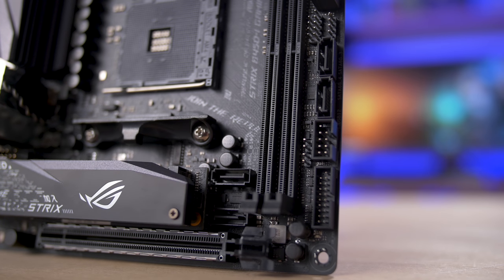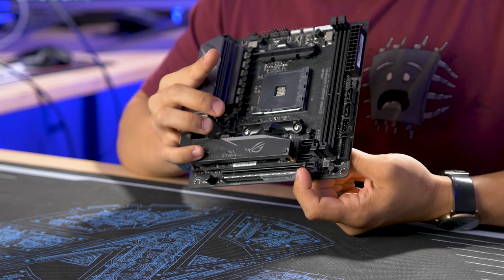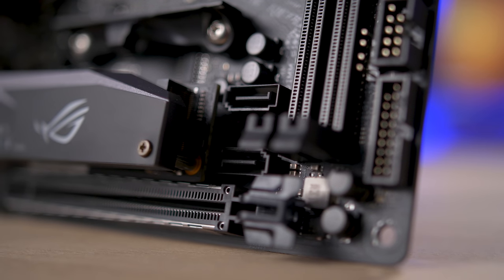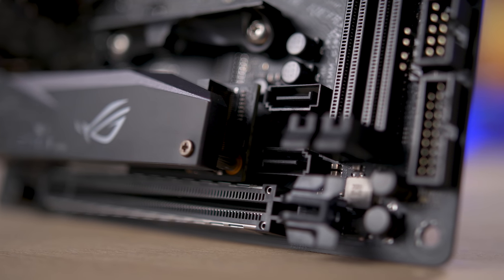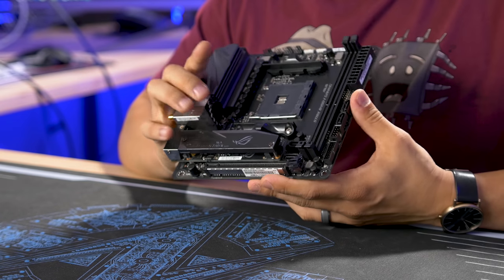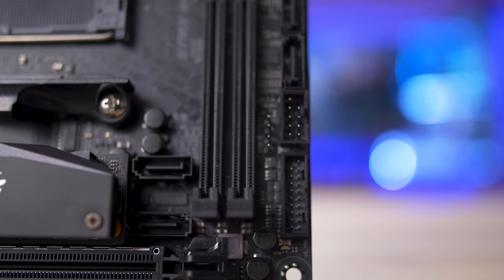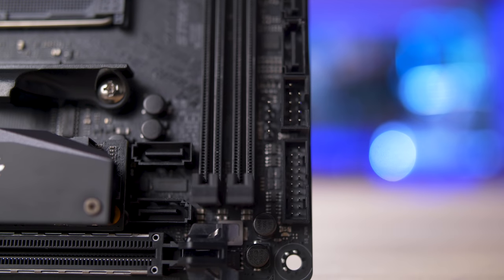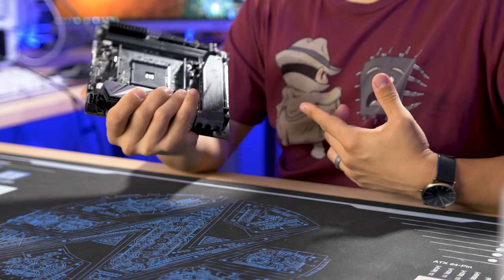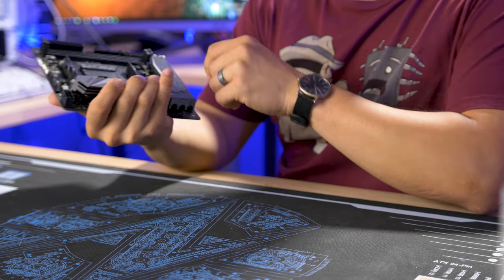Additionally, we've got an arrangement of SATA ports — two on the right side of the board and then two more just above the right side of the PCI Express slot. That seems like it might pose some cable routing issues since they're at a really awkward spot and a bit more inland on the PCB than usual. You've also got USB 3 in a good spot on the bottom right corner of the board along with a single USB 2 header.